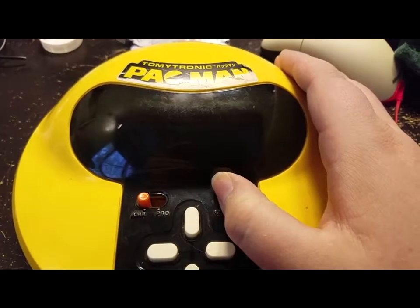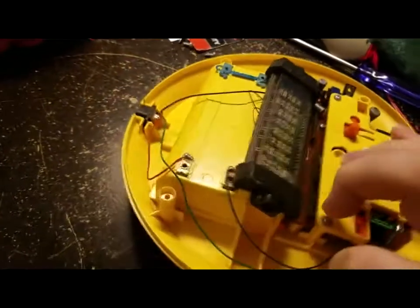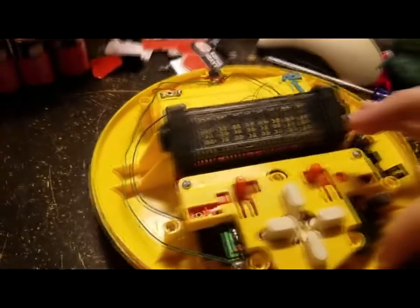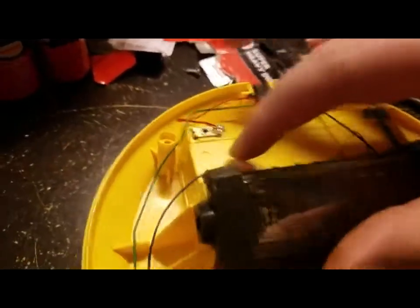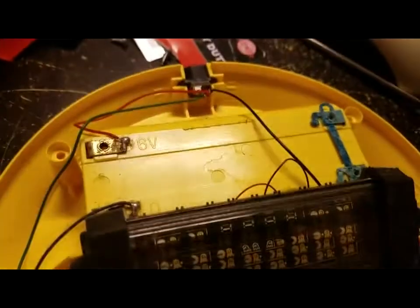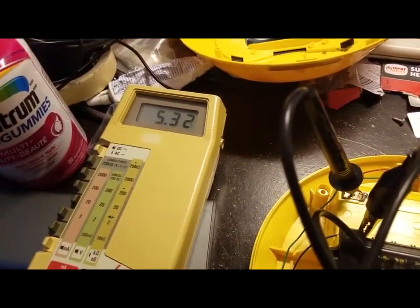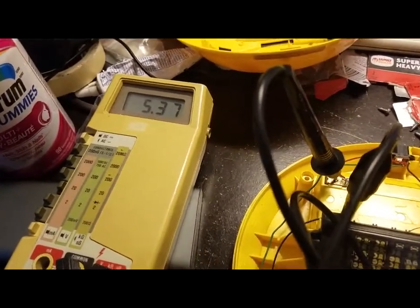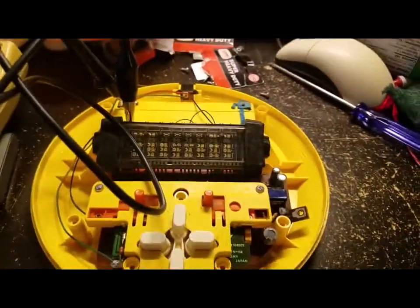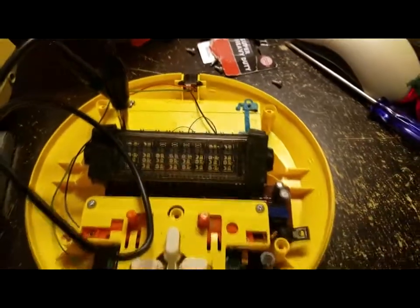Let's find out. Nope, still no go. Inside the unit there's that nice vacuum fluorescent display. Can we see who made the display? NEC. Very cool — I didn't know NEC was in the vacuum fluorescent display business. These wires are still intact. This series bridge looks like hell, but I'll test the continuity anyway and make sure that six volts is appearing here. Well, there's your problem — it's still the battery compartment. You can see the voltage is sort of all over the place; it's definitely not six volts. It should actually be 6.4 volts because those are new batteries. And if I turn the unit on, it drops right to nothing. So we've got a high resistance in the battery compartment still. Time to measure the resistance across this bridge and other parts and see what I can find.